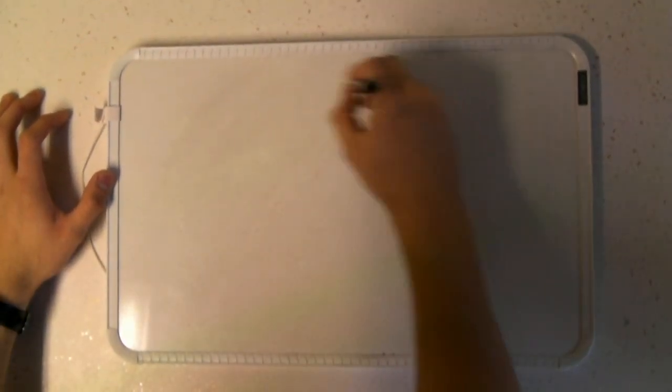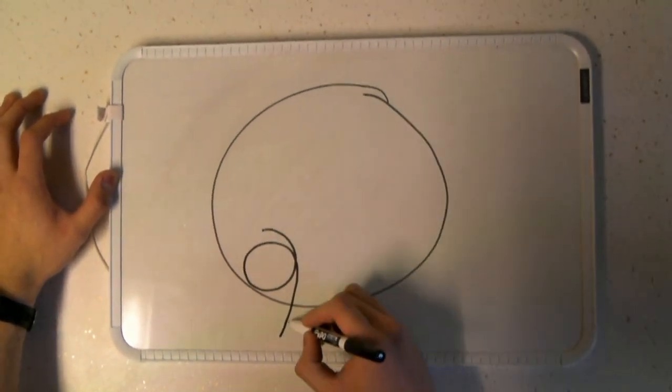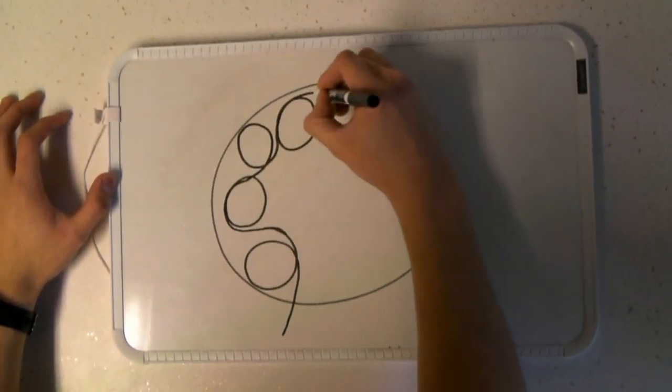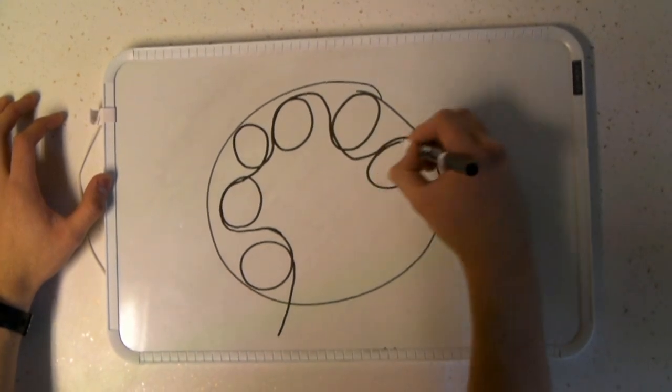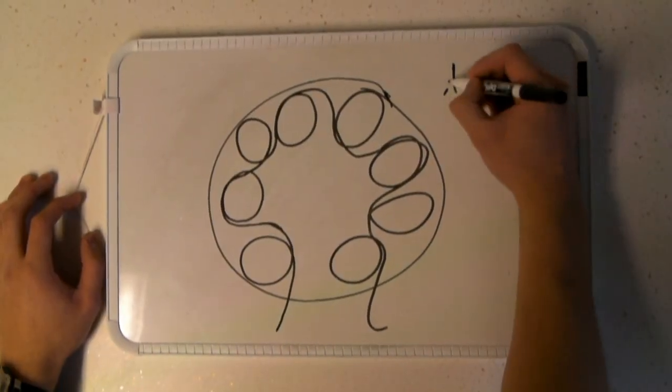The coiled copper wires are wired in series and are wound with the coil segments each reverse in alternation, so that one coil is wound clockwise and the next is wound counterclockwise. This creates an alternating flow of current, with the current changing direction every cycle. As the current flows within the coils, it generates its own magnetic field.